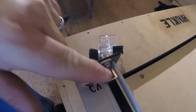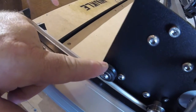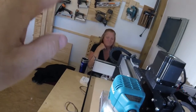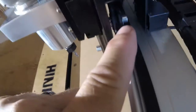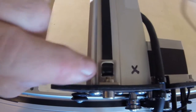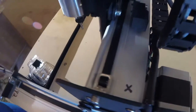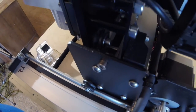Alright, I'm going to swing the camera around. These little connectors for the belts — they were shifted that way, interfering with that pulley. This one, that one, that one, that one — and specifically this one. The way I resolved it was: I took a screwdriver and a hammer and I just gently tapped on that to move it over. Now I'm going to slide this over manually and show you that it now goes past that belt clip.